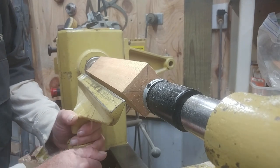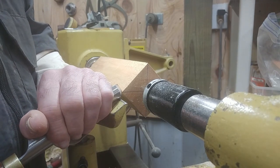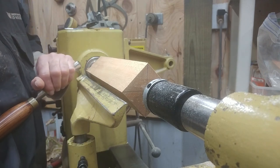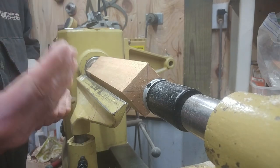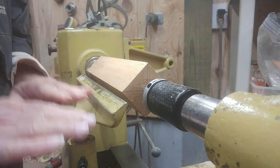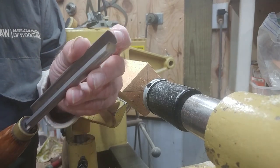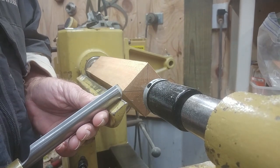Once you identify that center point, that is your center axis. With this line drawn all the way across and the tool rest raised so my cutting edge is at center axis — just like this right here — I can follow that tool rest all the way down and trim the piece. If I'm below center axis I won't get a good cut, and if I'm above it I won't get a good cut either. Get your cutting edge right at center axis, parallel with the bed.